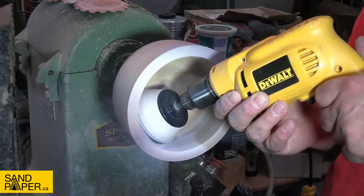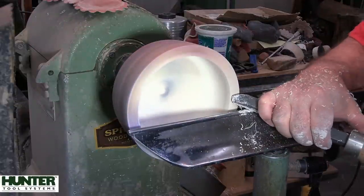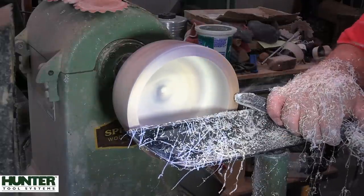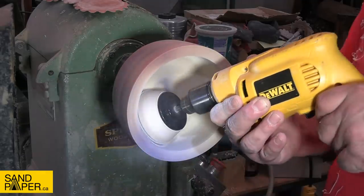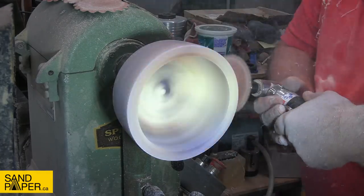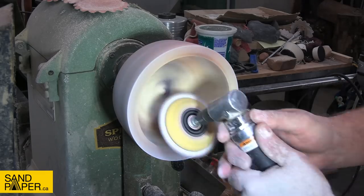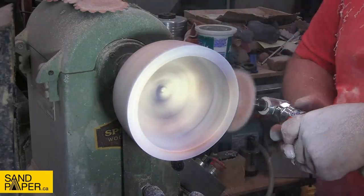We're sanding from 60 to 800 on this piece, using three-and-a-half inch Dippedisc from sandpaper.ca. I started to sand this and I realized I never actually did trim the very top, so that's why I went back to do some trimming — I totally forgot about it. All of the links for any products you see on this channel are in the description. Designer Epoxy is another fantastic product — I'm so glad that Gabriel has sponsored my channel. And of course, you can't be a woodturner without CA glue, and that's where Starbond comes in.